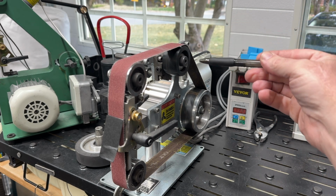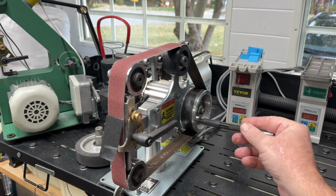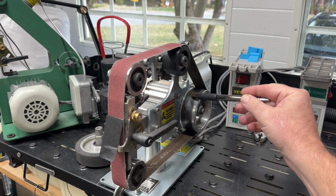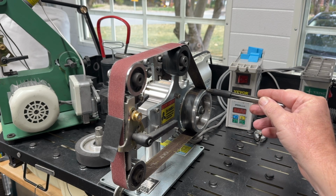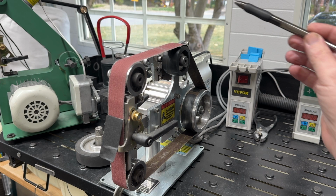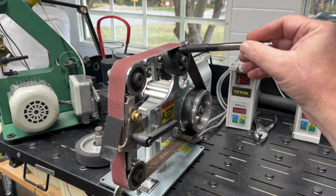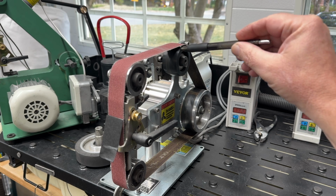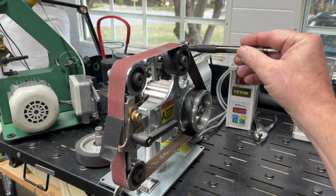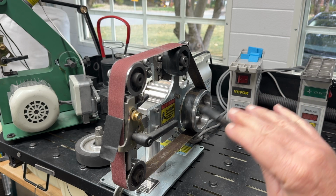If you still have the flat one, you can do what you see that I did to this drive wheel down below. I added just a tiny bit of electrical tape to it, and that will work too. It gives you just enough arch. It helps the belt stay on better. And for a long time, I just added maybe 0.5 millimeter of electrical tape to the flat wheel that was up here, and that worked great for me for a long time.